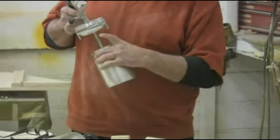At this point, remember, we dyed it, sanded it with 120, dyed it again, and if we'd have needed to, using 80 would have been all right. Dyed it again, came back, and sanded again with 120, and then this is a 180. Now, remember, we're using one part orange, what is it, three parts of the light brown? To intensify the curl even more, we could use the light brown all the way through up to the last coat. That makes the curl even darker.